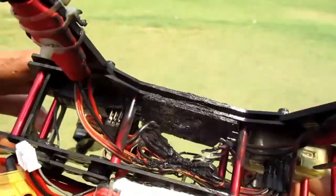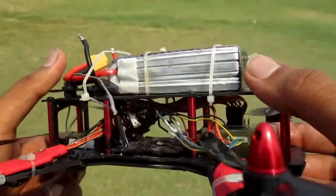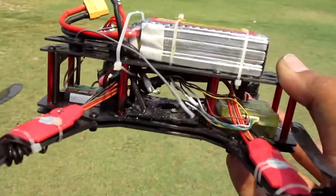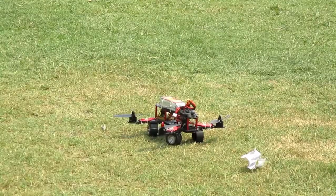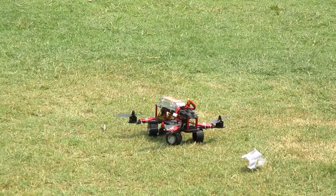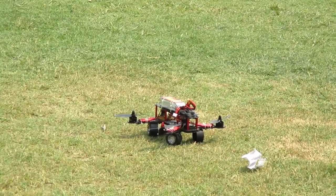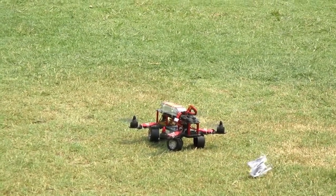When I examined it, I found that it was due to loose soldering between the battery wire and the ESCs. So this was a lesson for me. As someone well said: learn from the mistakes of others, because you don't have a whole life to do them by yourself.